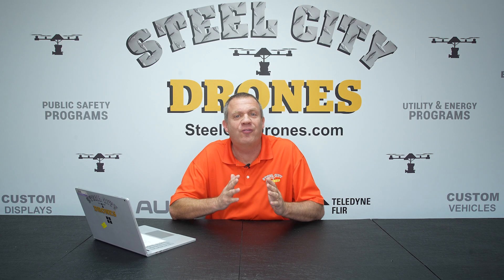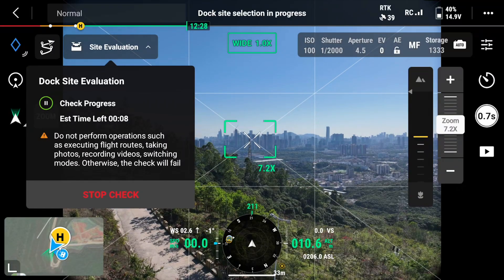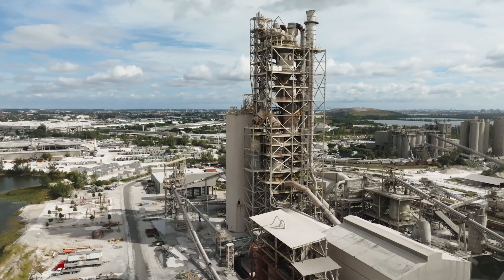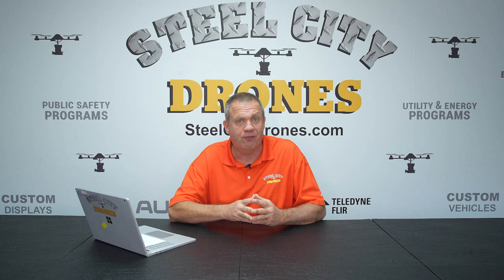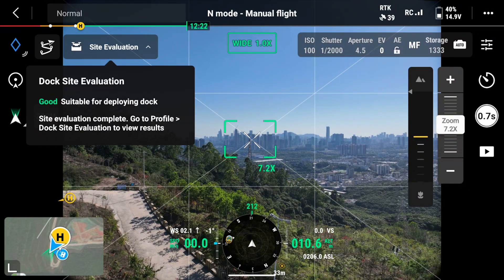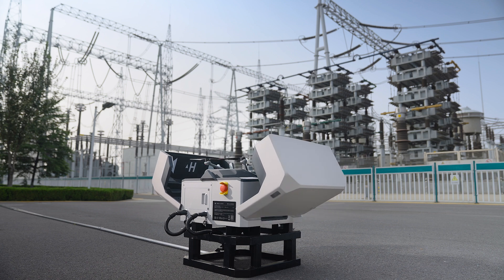There's a really cool new feature called site selection that's going to help you evaluate where you're going to be able to install and set up the dock station. Previously there have been a lot of challenges figuring out the perfect ideal spot for installation. Now, before you install the dock, you can fly the drone in the intended area, and it will do an automatic evaluation of the surrounding area in approximately 10 minutes, giving you really good feedback on where you should install the dock.